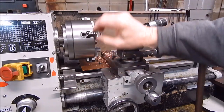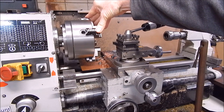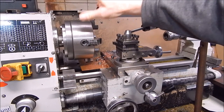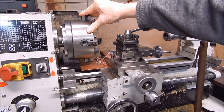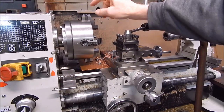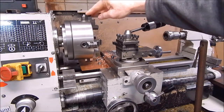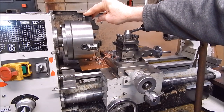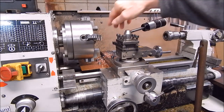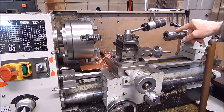I've got the big six-inch four-jaw chuck on it. I'm one of these guys that believes 10-inch swing is really as big as you want to go for the home workshop if all you're going to do is model making and repair work. If you go over 10-inch swing, the chucks are going to get damn heavy. That six-inch chuck — if you want to swap it back to the five-inch — is one heavy mother. Once you get past a six-inch chuck, just remember they're going to get bloody heavy.